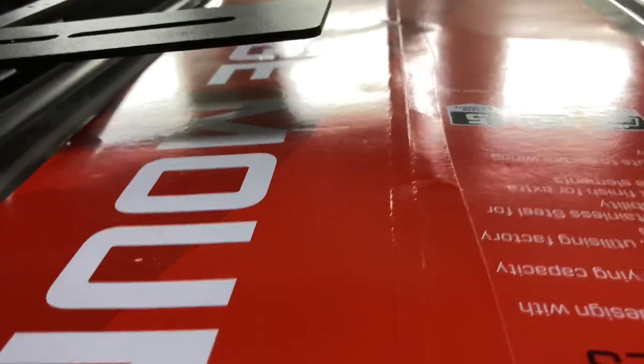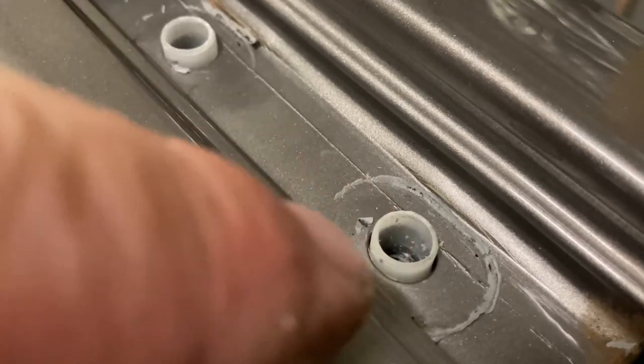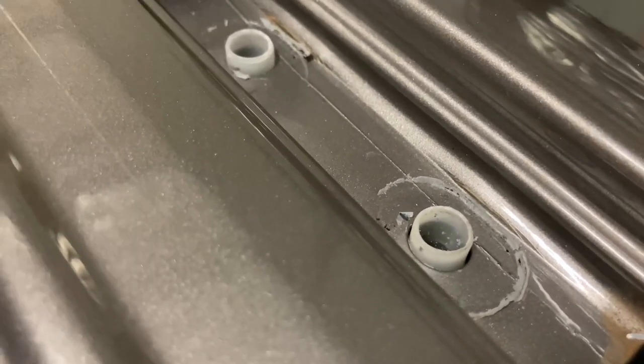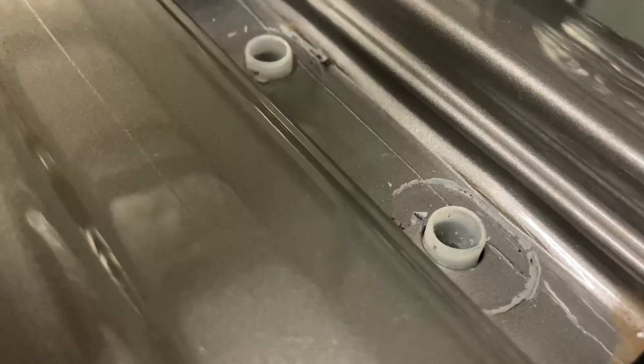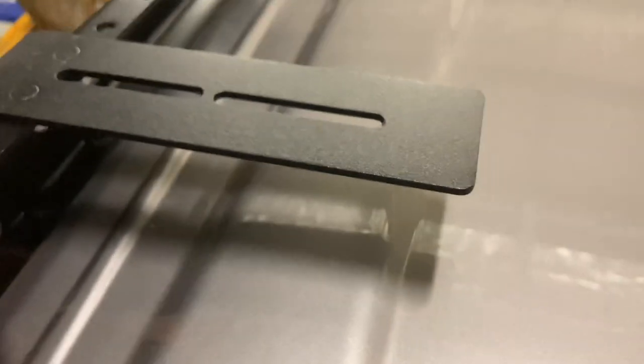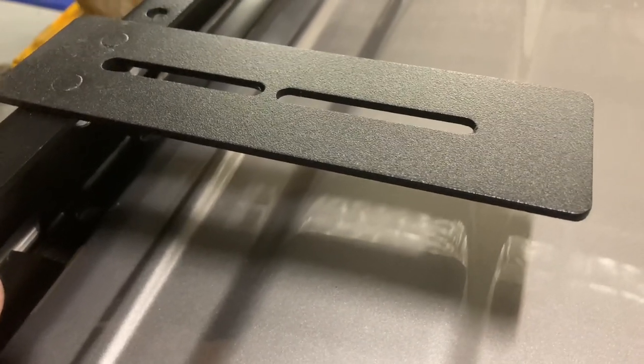All locked up — locked those up earlier. You can see where the bolts are going to go. Before you do that, we're going to sit it gently over this side. It's imperative that water doesn't get down, so I'm going to put sealant on the bolt threads. You can use roof and gutter seal, RTV, whatever you want, as long as it seals those threads. I'm also going to put some at the bottom here. There are rubber washers — I'm going to put sealant on top of those, then it's going to sit on top of the rubber washers. There'll be a bolt, a washer, and a spring washer on top — the 25 mm long ones, should be 12 of those. Mount this, it sits like that, then bring the tray along and use the remaining bolts — should be 12 total — bolt that up and bob's your uncle, job done.